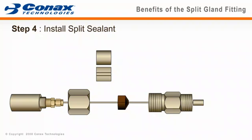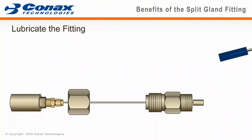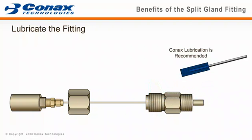Be sure that the beveled side faces the already installed seat and insert into the body. Next, install both halves of the split follower onto the element and slide the combined follower into the body. All internal cap threads and follower ends are supplied with Connex lubricants. Use of any other seal lubricant may affect sealing capability and torque rating.